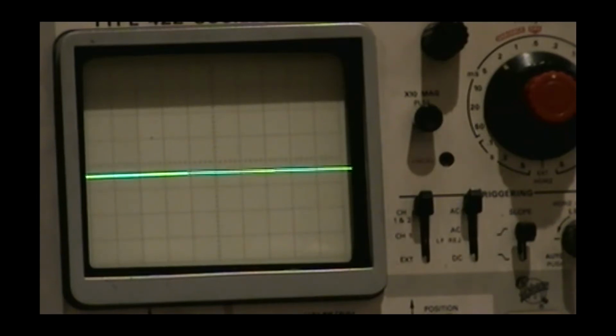With the digital scopes that I have seen, and you can go spend $100,000 with a Rohde and Schwarz and minimize this, but with the ones that I've seen and worked with, the display is made of pixels. And if you've got a horizontal line with no signal on it, you're going to see the odd pixel above and below and above and below, so that a tiny anomaly could be there and you wouldn't know if it was from pixelization or if it was a genuine anomaly. So there's a difference. And it's like the meters, there's a trade-off. It's not that one's intrinsically better than the other.